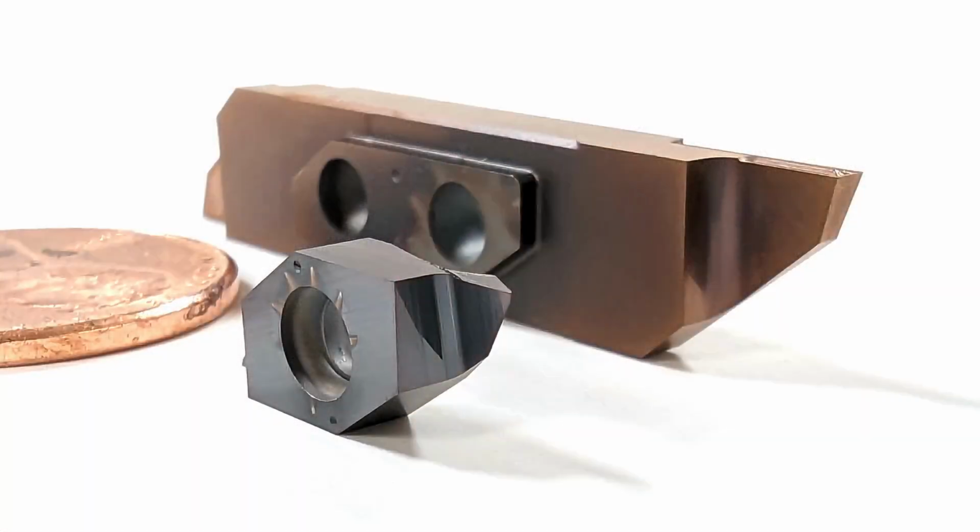when you're talking about something, say, 3 millimeters and under is really where it shines. But you can also utilize this product on some of the smaller diameter machines, like, for example, a Tornos Swiss Nano or maybe a Citizen L12 is a really good situation where you might look at the 1600 series over the 3000. You could use both interchangeably between both pieces of equipment, but one is a little bit more specialized over the other.